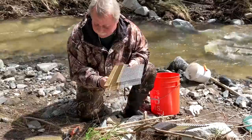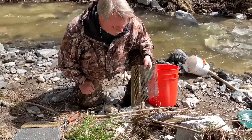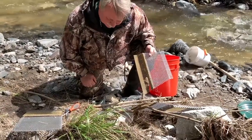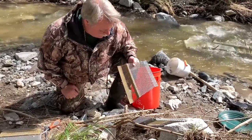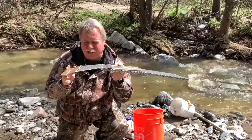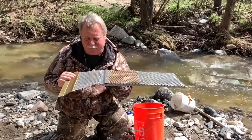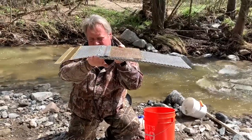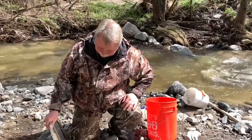I think we need more water, Pat. See the back of the box is out quite a bit. I kind of like it straighter — I think that right there is the difference it's going to make. I wonder if there's any easier way to fabricate these — it's just so hard to compete with grizzly bars. You can't water jet them. This one here has a little different profile — the screen is tilted up a little bit, which I like. That's why this one works so good. It's going to force more material through it and increase the flow and velocity underneath this section. I like the flatness though — it gives it less energy to carry it up the hill, but we'll have to try it.